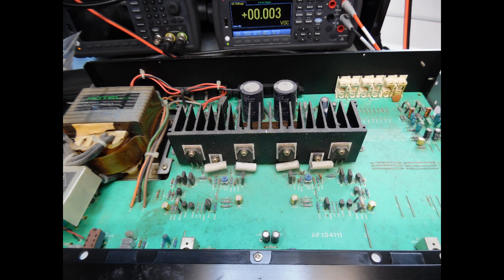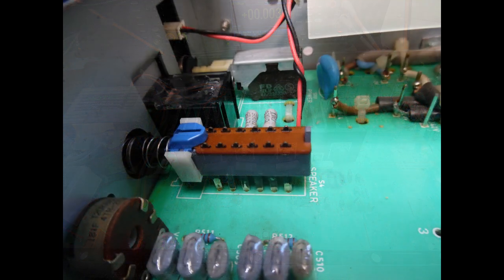In terms of fault finding, it was really quite straightforward. You have a dedicated latching push button which selects the secondary sets of speakers. Once the bottom plate was removed, there was no issue with the output stage, so the fault had to be either the tracks leading to and from the switch, or the switch itself.